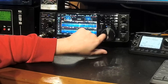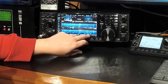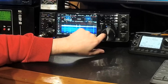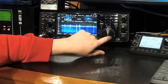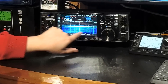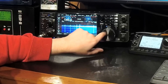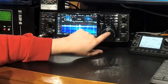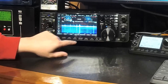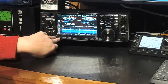When you turn digital select on, the radio makes clicking noises as you scroll around. With the right sort of conditions, you can see — I'll turn the dual scopes off for the moment and expand — that with digital select on, as you roll through the frequencies, the display seems to dim on the edges. If we roll all the way to the top of the band, you'll see it's dimmed down there. That's the digital select doing its job. The nice thing about the display is that it will show you the bandwidth of your antenna, so you don't really want to add to that with digital select.